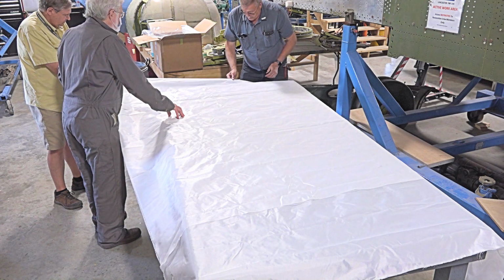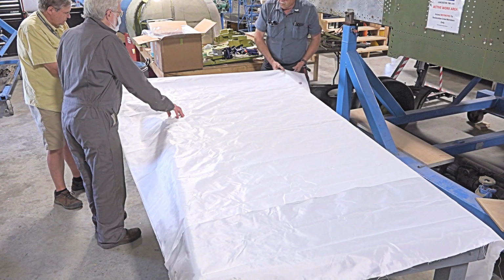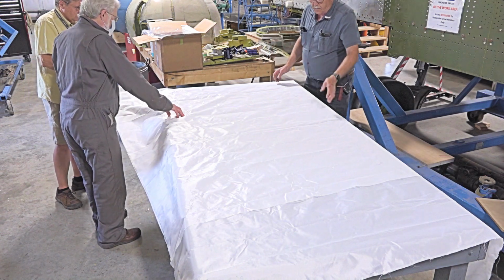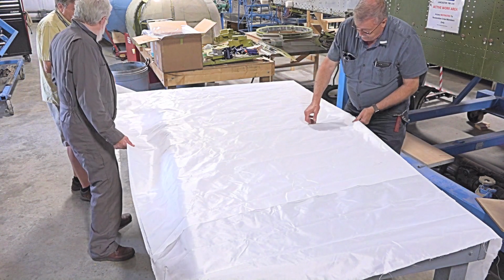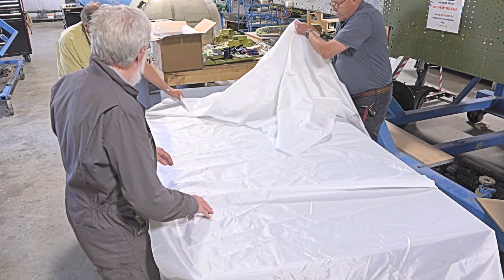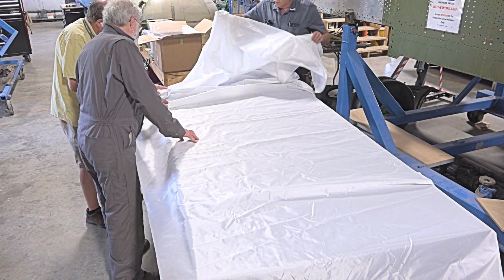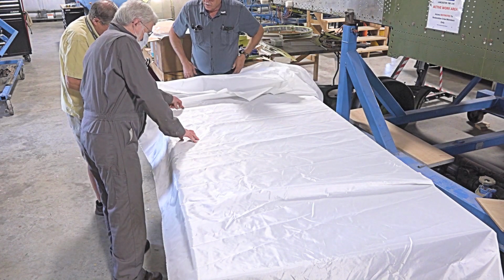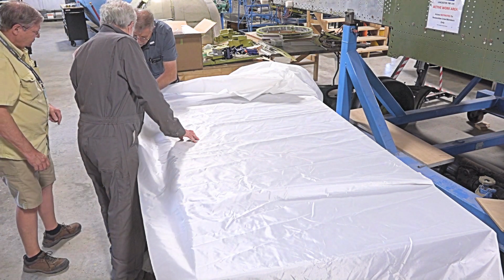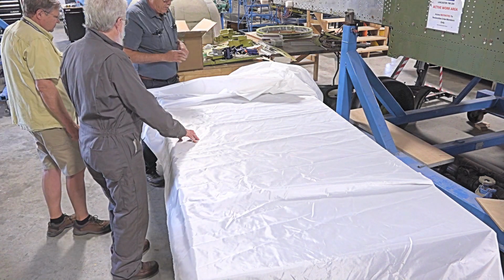So all I'm doing is putting a crease in it that I'll be able to follow afterwards. And I don't have to do any fancy marking out. So now we can pull this way. And here, just pull this. There, that's what I'm going to do. Okay, now let's fold this up. That's your crease there. Here's the way to do this. Just take it and do this. Right there. Yeah, we'll do it there. So now we know where that is. We don't have to worry about it.